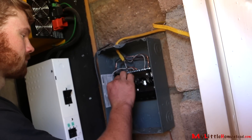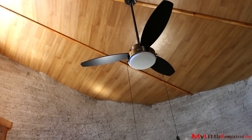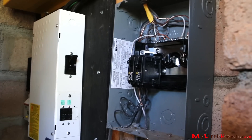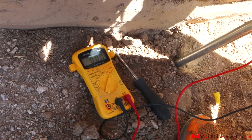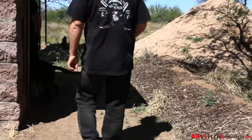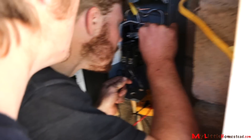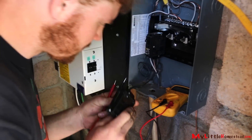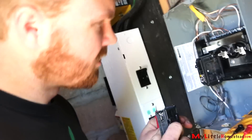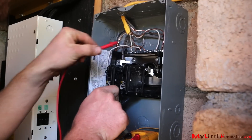It's going to have to turn on. So you have lights. Shut it off — we don't have power. We know mine has power, so maybe something unhooked. You have a wire that's not connected up in here. I see no juice. That maybe is the breaker. There's voltage there — so it's the breaker. The brand new breaker. Oh, I see what it is — it's in the wrong slot on the bus. We should have power now — it was just in the wrong slot.